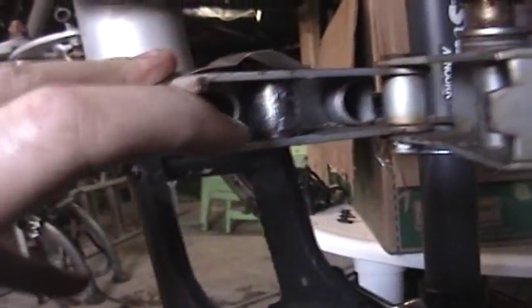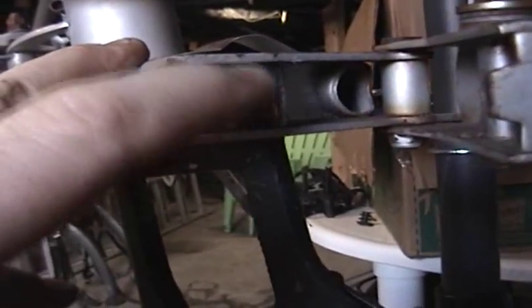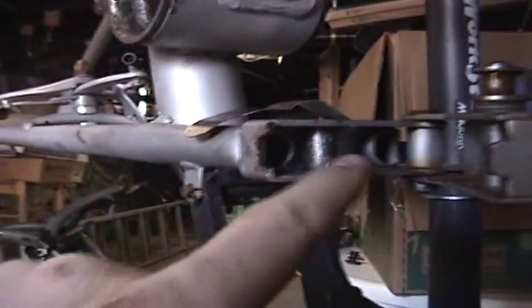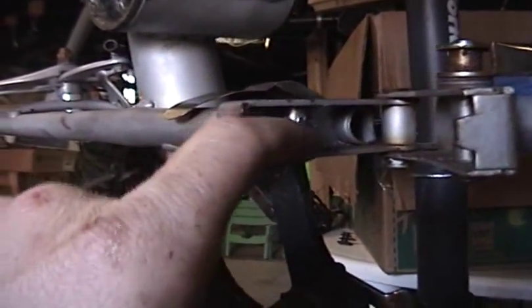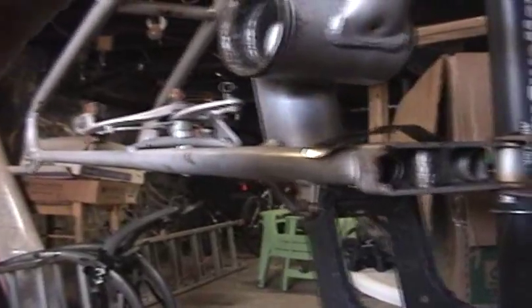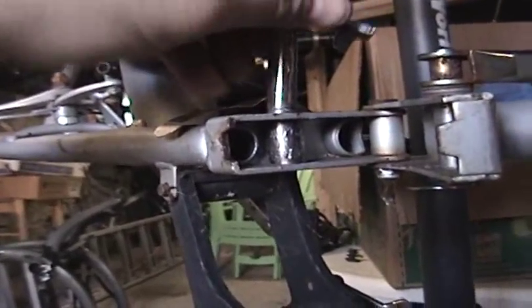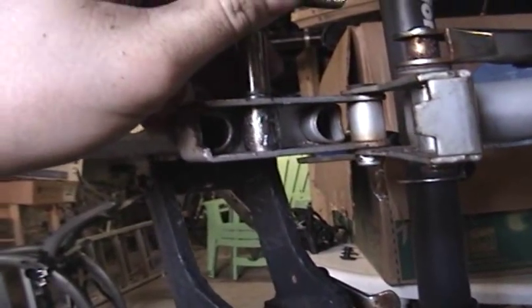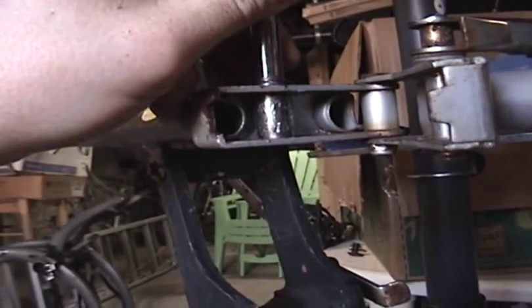I've been working for a while in the garage with my tools, and you can see right here I have made the new guide tube slash bushing which goes straight through the frame here. The pin, which you see is all dirty from repeated fittings, actually fits through this tube very tightly, so I don't think this will ever wear out.